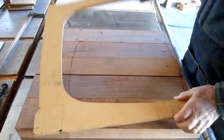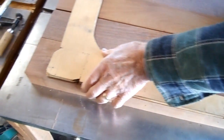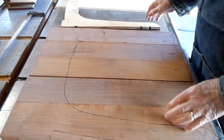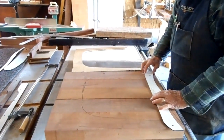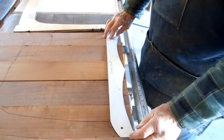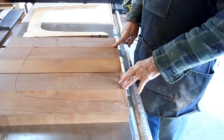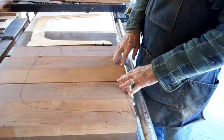On one side, we mark the location of the front and back legs, then mark both sides. We take another pattern and mark the front of the seat. This is also available in the patterns, or as a jig. You can cut the front of the seat out at any time before we do the tapering, or afterwards — it doesn't make any difference. But you want to do it before you glue any of the boards together.